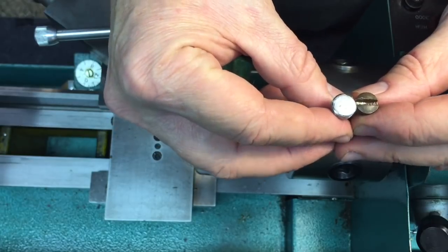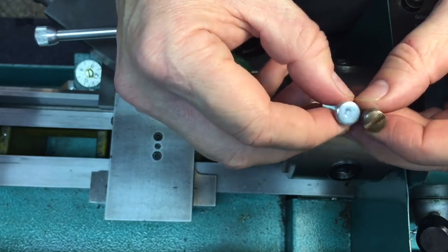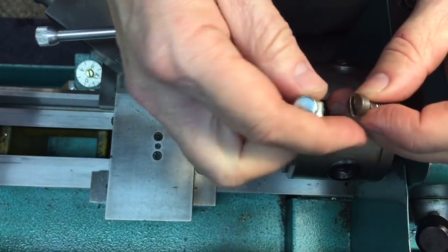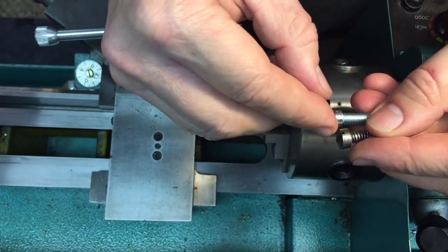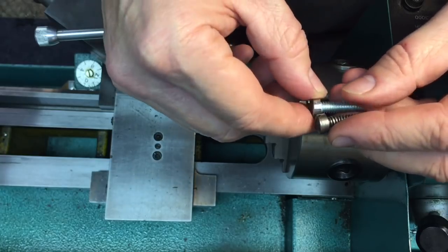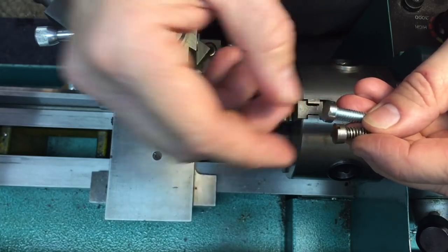It's not the exact size yet, but we're going to trim that down in the lathe. You notice it's got that nice convex shape here. We're going to put that in because even though it won't be as thick as the original head, when you look at that collar you'll see it's nice and curved and convex. So we're going to put that in there, make it convex, and then cut the slot in.